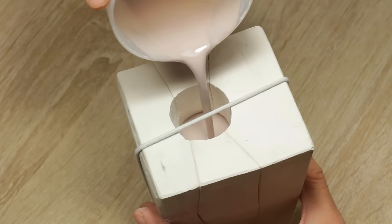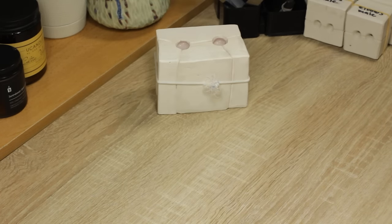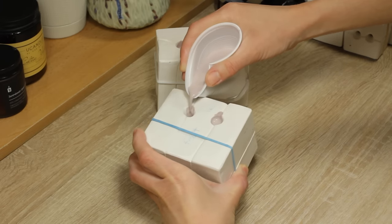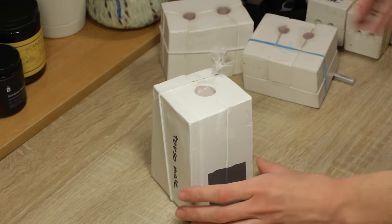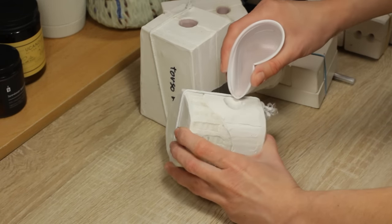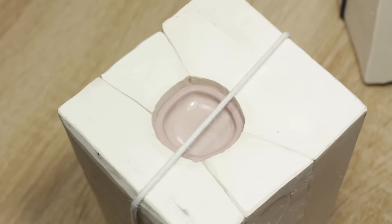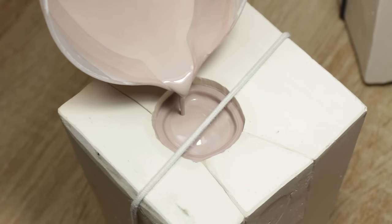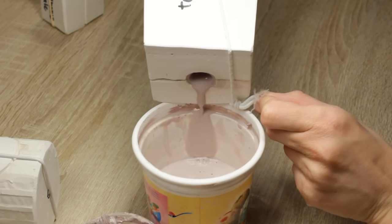The two dolls consist of 38 pieces in total, and I cast them all one by one. When the porcelain slip is poured in the mold, plaster starts to soak the water out from it. This means that the slip that touches the inner side of the mold dehydrates and becomes solid. As the time goes on, this layer of solid porcelain gets thicker and forms the casts. The slip in the middle does not become solid, so I can pour it out. That's why the casts are hollow on the inside.